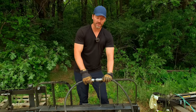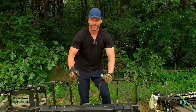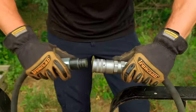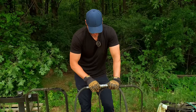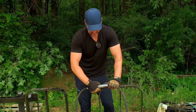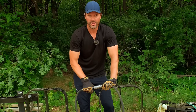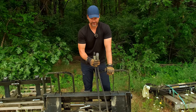So now we're looking at flat face couplers. Pretend one of these is on the machine side and one is on the attachment. You need to just pull back on a collar to release. Now the difference is the fact that these are flat faces, and putting them together is really easy — you just take the male side and push it into the female side. There's no collar that you have to push back or pull back on; you simply push it in and it locks in place — you can hear that snap. Now, for lack of a better term, you have a dot and a slot. If you have that not aligned, you can't pull back on the collar to release it — it's maybe a safety mechanism of some sort. If you align that just right, that's when you can push back on it and everything releases just fine. So if you can't get the coupler to release, maybe it is a pressure issue where you have to relieve the pressure, or maybe you just have to align that slot properly.